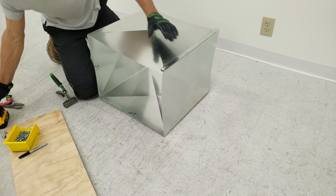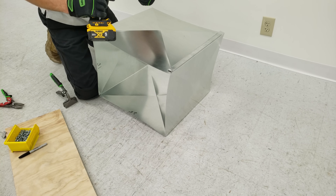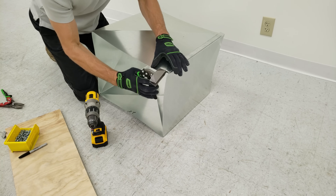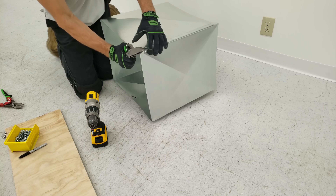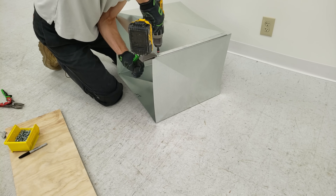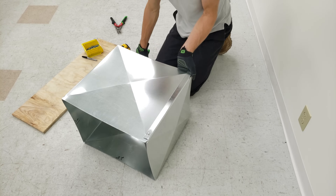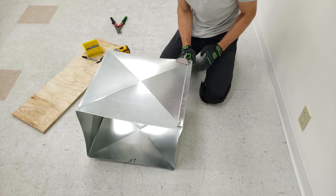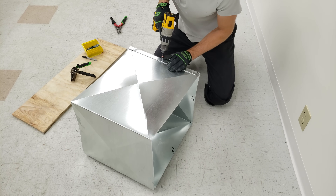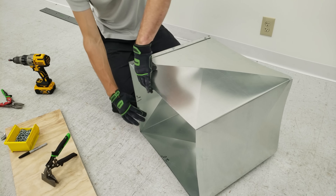Any time you're putting metal into a piece of slide — also referred to as slip, s-lock, or slide — you're going to put one little corner in at a time. That's nice and lined up. We'll take our drill with self-tapping quarter inch screws — in this case we're using quarter inch. I like to pull it towards myself or hold it with hand brakes, and we'll just fold it right in.